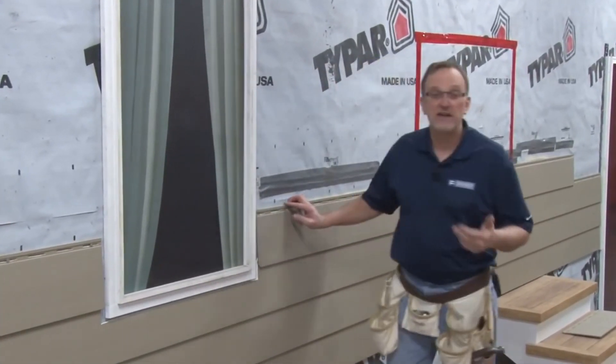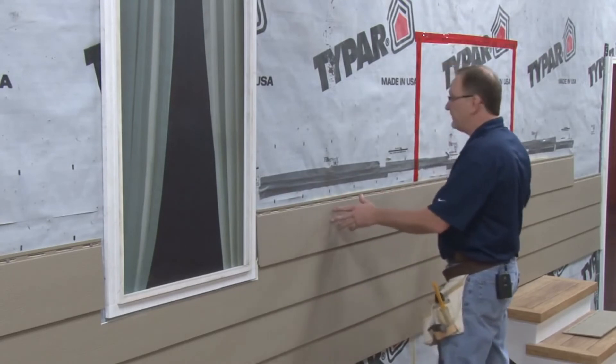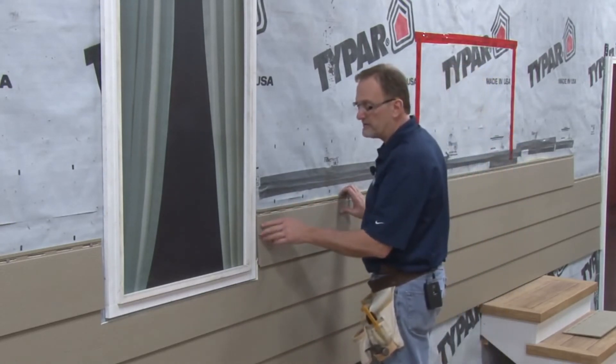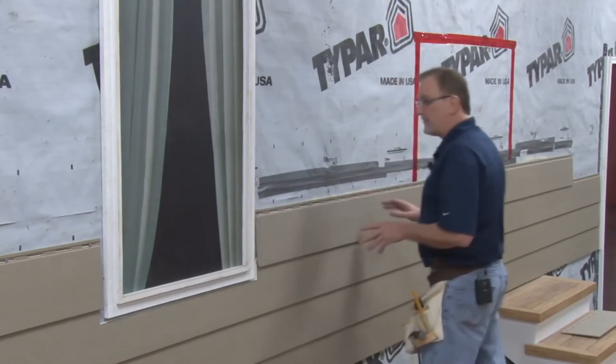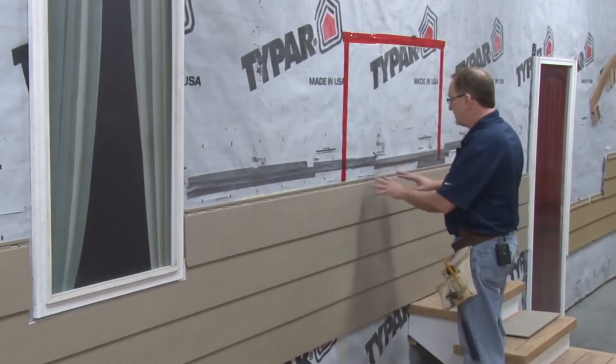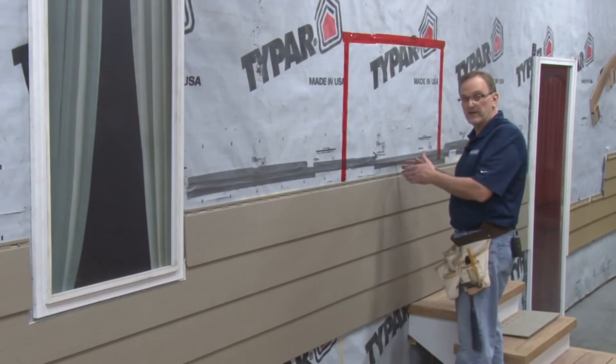Now on this side of the window, I can't make that same choice, because this course is longer than 12 feet or one panel in length. Therefore, I need to make sure that I retain that one inch setback here. The other thing that I need to be aware of is that because of that window, the center of my course has now changed. And therefore, I have to change my center pinning accordingly.